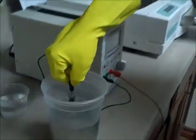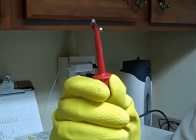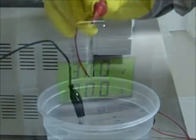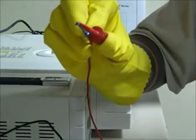I've got an anodizer in the piercing room and we're going to anodize a piece of jewelry now. I have to wear rubber gloves for safety and hook a couple things up. I've got a titanium barbell here — we're going to turn this thing blue, which is about 30 volts. We're going to dip it into the anodizing solution and almost instantly it turns blue.